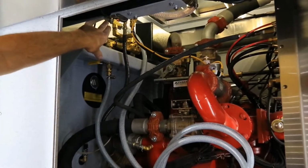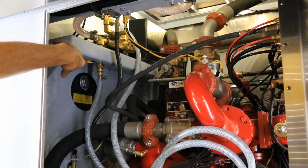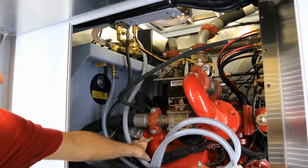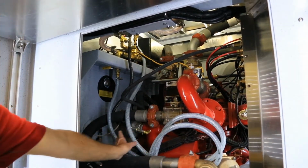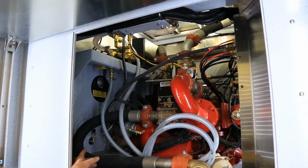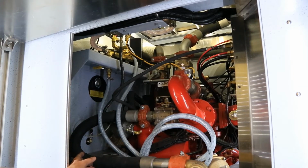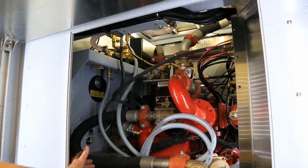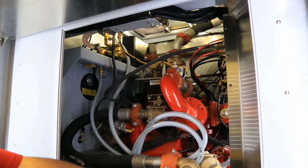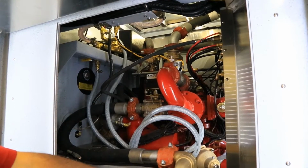The foam system strainer and drains are all here in this area. What you see here is the Darley high pressure pump section that feeds the bumper turret to the front and the hose reel that is on the right hand side of the truck, which we saw in the inspection video. Moving down here, what we have are the two Chicksan swivels, one left, one right, for the speed lay drawers.